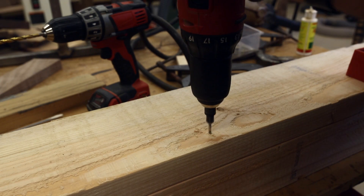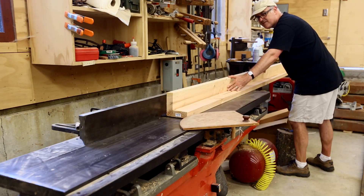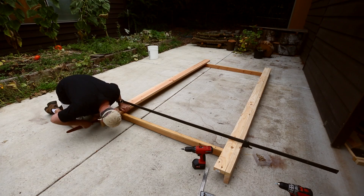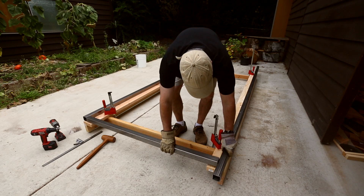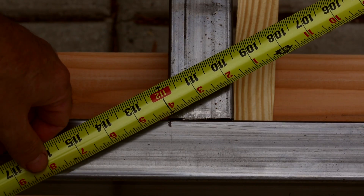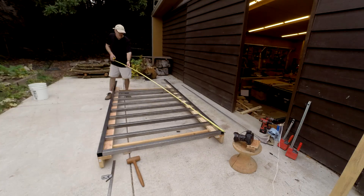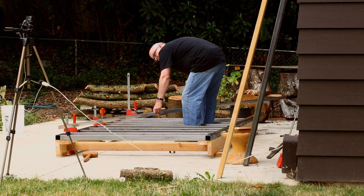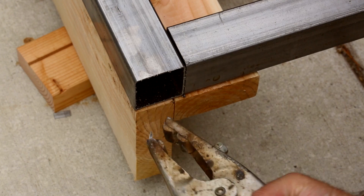The plan was to weld the parts together. I decided to make a wood platform so the pieces for the top frame would sit nice and flat in a single plane. I built two side rails, clamped those together, and laid out the steel on those pieces. Then I checked that the frame was square and, more importantly, flat — using various straight pieces of material to check between the corners and ensure I was making a single plane and not a warped one. I could adjust by putting a shim under whichever corner needed to be raised.